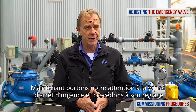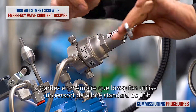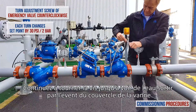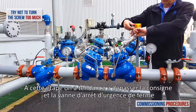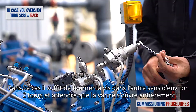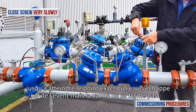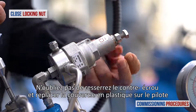Now let's turn our attention to the shutoff valve and calibrate it. Slowly turn the emergency shutoff valve's pilot adjustment screw counterclockwise. Bear in mind that when the standard 16 bar spring is being used in the pilot, each complete turn of the adjustment screw will change the set pressure by approximately 2 bar. Continue turning the screw until you see water exiting the vent on the valve's cover — this is normal and signifies that the valve is about to close. There is a tendency to overshoot the calibration at this stage and the shutoff valve will inadvertently close. If this is the case, turn back the screw about two turns and wait for the shutoff valve to open fully — you can see this by observing the indicator. Then start to close the adjusting screw very slowly until you reach the exact point where the water exits the valve control chamber, but the valve does not start to close. Don't forget to tighten the locking nut and replace the protective cover on the pilot.